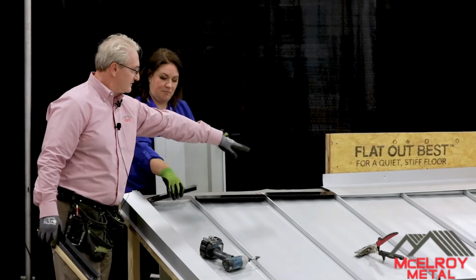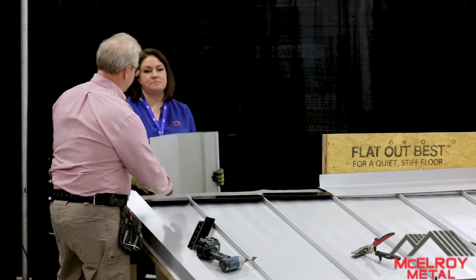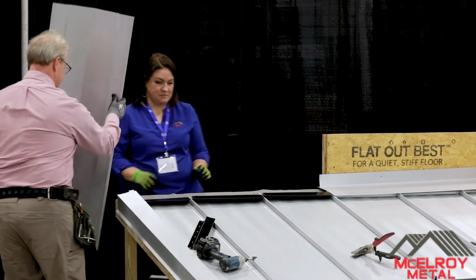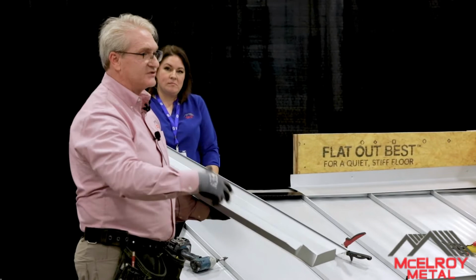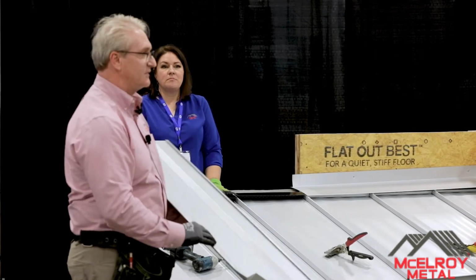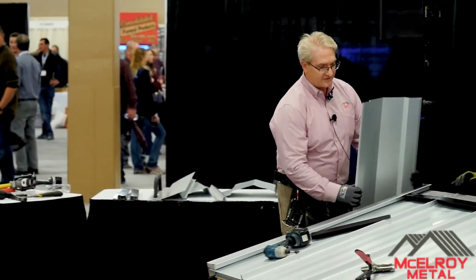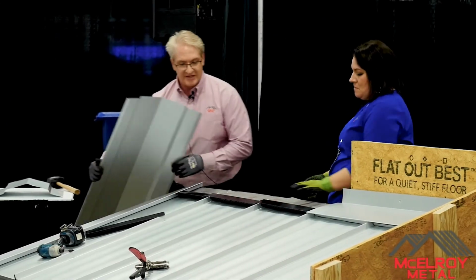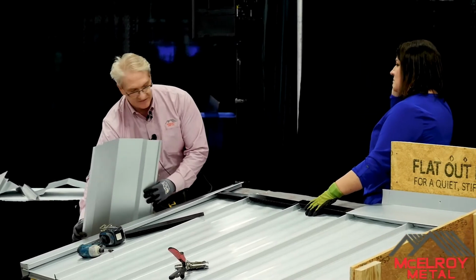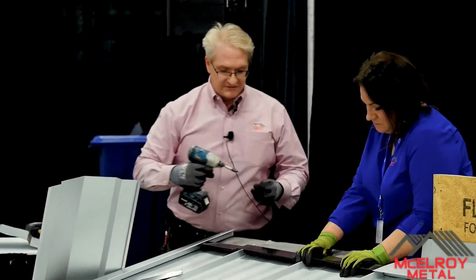So remember I made my marks on top of the rib over there? Well, guess what? I'm gonna do the same thing with my ridge cap. Got it here. Thank you. We have open hems because we have to hook into it. I like to try to keep screws off my roof as much as possible and only use pop rivets the color of the steel, okay? So once we're set, I always do a dry fit and say where I want it. I'll make my mark on the ribs and now I know where to set it. Again, I set these about a 1/4 inch back from where I'm making that mark so that I'm not fighting the actual ridge cap. So we're going to screw a couple in here.